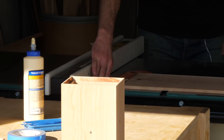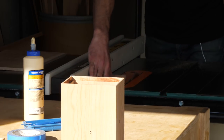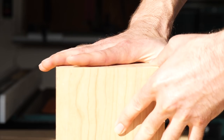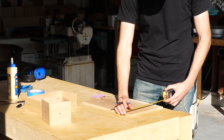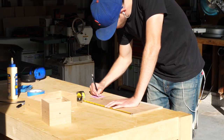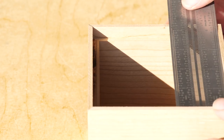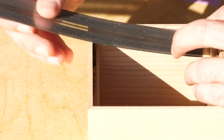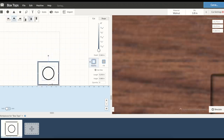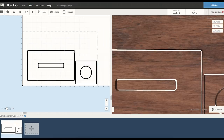After they had dried up for about 45 minutes, I started fitting my top pieces. I'm making the top for the vitamin box here — this was the easiest top because it's just a solid piece, so after it's cut to size you can just glue it in. For the other two boxes though, they dispense from the top so they needed holes to allow them to function properly, so I decided to make these on the X-carve instead. To prep that, I started by measuring the piece of wood I would use to yield my two tops, and then measuring exactly how big they need to be. I hopped onto my laptop, opened up Easel, and started drawing out the tops and the holes that I would need to cut in them. Then finally I got everything set up and made the cuts.